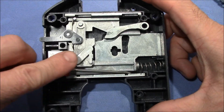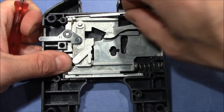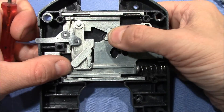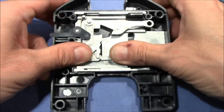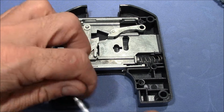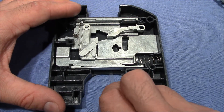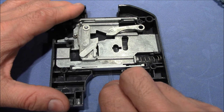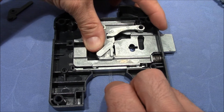When I turn the wheel, the wheel would travel to the left, but because the plug is stationary, instead the bolt will move to the right. The bolt will move to the right but it stops because of a spring-loaded lever — that's one of the fences here. This spring-loaded lever blocks further movement of the bolt. That's where the plastic strip comes into play. If we find the right spot — a wider strip would probably be better — we can see how it lifts the lever, and now when the bolt moves to the right we can move it all the way to lock up the door. That's how the manipulation works.